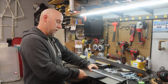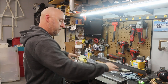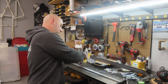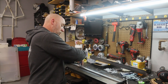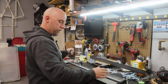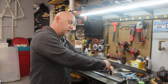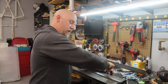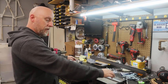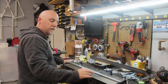Let's say I wanted to put a break in this. To work it, you'd put it underneath this piece here and then clamp this down. I'm going to put a couple of clamps on here. What I've found is, especially on a longer piece, if you're doing 16 gauge at more of a full width piece, you have to have more than two clamps — you need clamps on the ends and then one or two more towards the center.